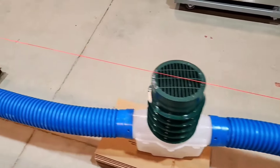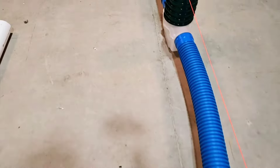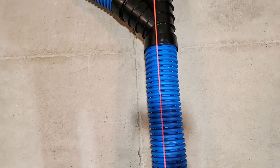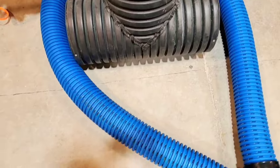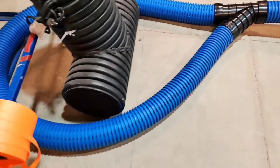We're going to have 2% slope on this system. Right here you go to perforated pipe — you're in your sump pit. You dig out this big hole and just go ahead and loop 8-slot perforated pipe. It has holes on the top, on the sides, and on the bottom. Just go ahead and wire it together — it's that simple. No tools are required, you don't need a hole saw.